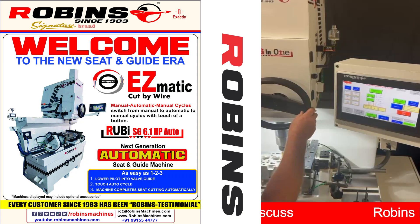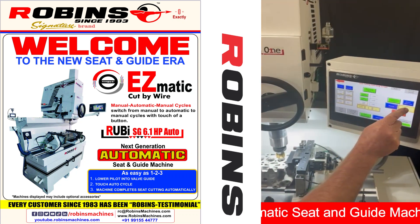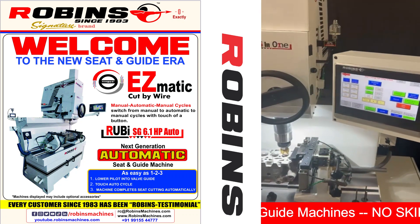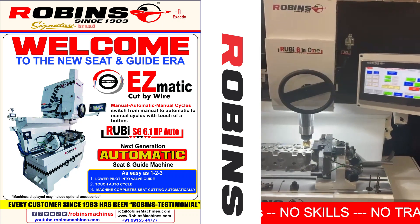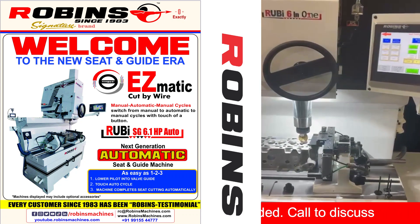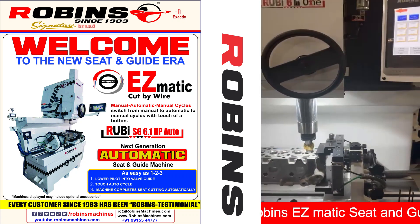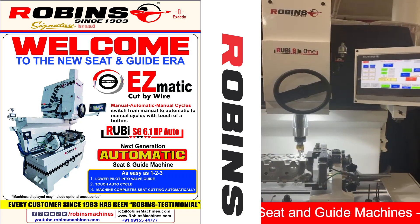Wind the wheel down until it stops turning and then press automatic. The machine automatically centers — preliminary centering and then secondary position centering — and then it goes down and cuts the seat. All fully automatic, unattended.